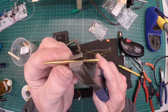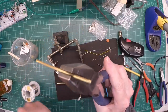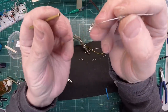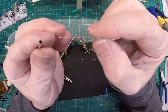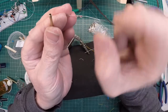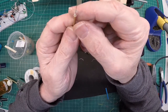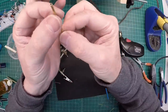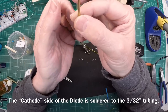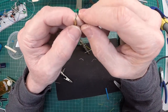Here's that inner probe — 3/32 inch diameter open tubing. Let me file the ends off and make sure they're nice and flush. You can see I've got the tubing cut. The orientation of the diode — you can see the green line on the end facing back this direction — I will insert it this way and solder it so the negative side of the diode is facing toward the probe tip itself. Let me get a bit of solder in here and just set that down in there, then we'll cover it up with some heat shrink.